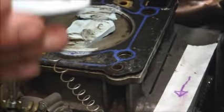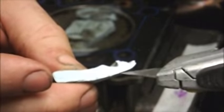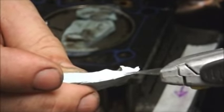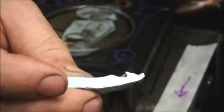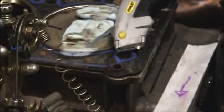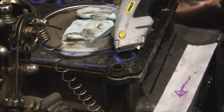And on this one, there's the face of the piston, and there's the face of the valve. So again, a good 3.5 mil maybe, I can measure that. So that's looking quite positive. There we go. So that there is our clearance, which is 3.7 mil. So if I took 2.6 off, that leaves me 1.1. That's not too bad. This might actually be viable. Okay, ta-ta!